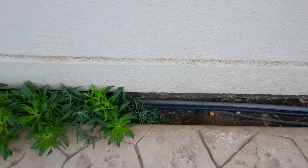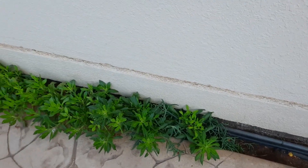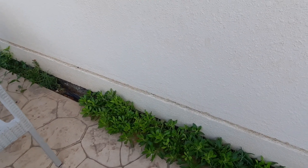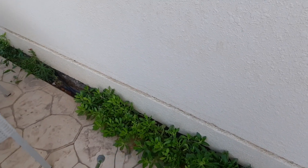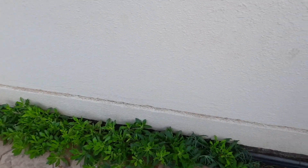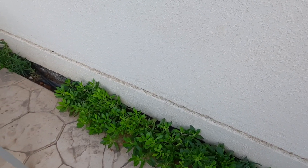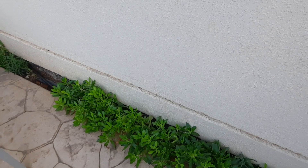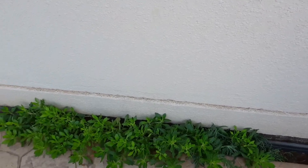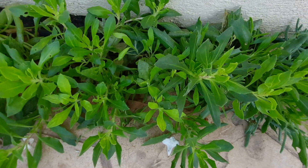All around the house there's a little trough — about 15 centimetres — left all around the house to stop it becoming damp, because most houses in Cyprus suffer from a bit of damp. When we did the concreting, I realised that concrete touching the house was the reason for the damp. So I made sure the concrete on the garden didn't touch the house, and sure enough it works — the house hasn't got any damp whatsoever.